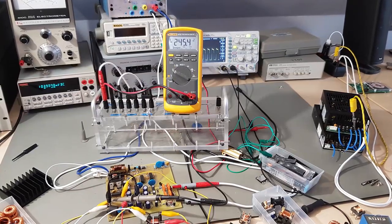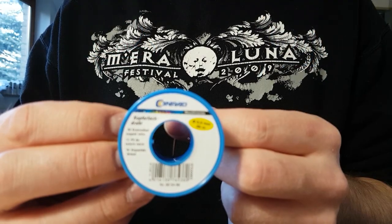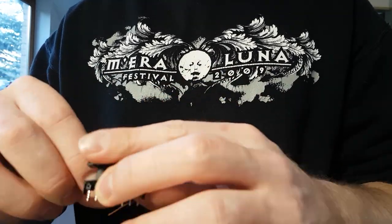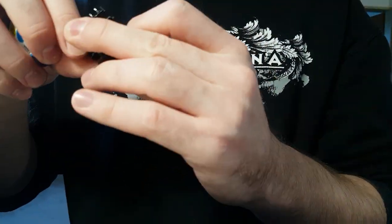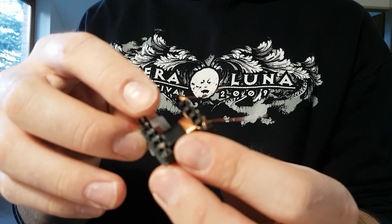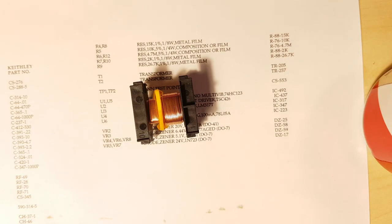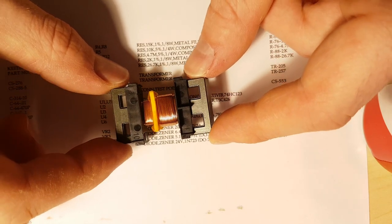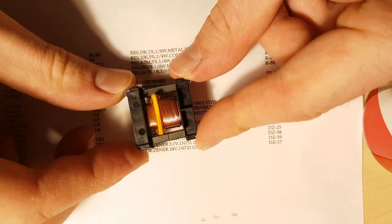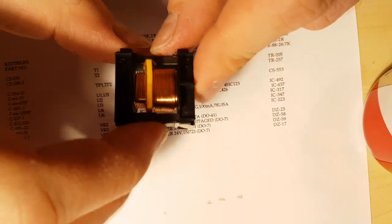I had more problems with the high voltage transformer T2. After testing everything I could find, 20 primary and 120 secondary windings proved to be the best performer. I'm including a spacer between primary and secondary because we're dealing with higher voltage here. The size of this transformer might be an opportunity for improvement — maybe the core gets magnetically saturated under load, but I didn't do any calculations.